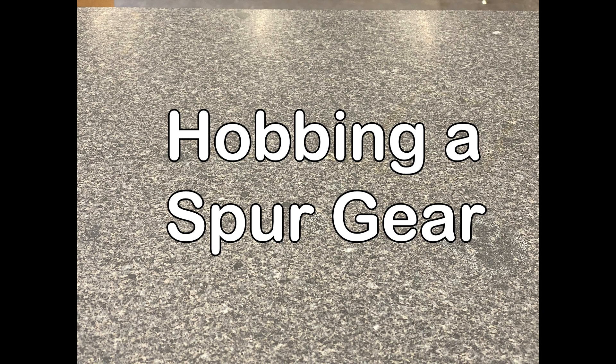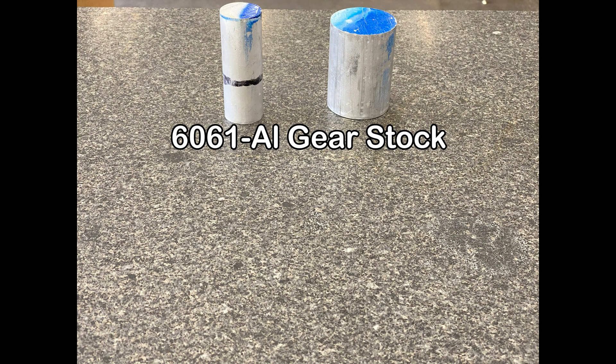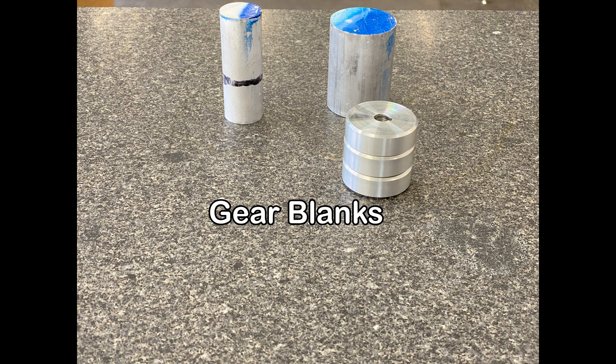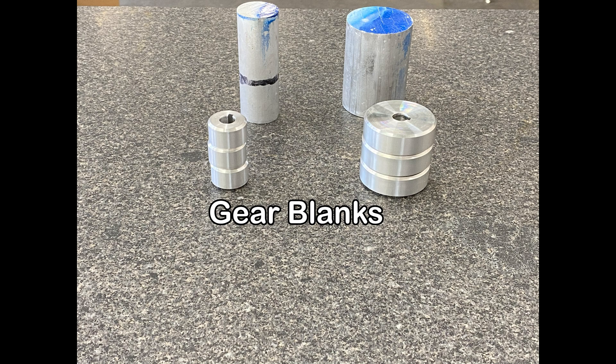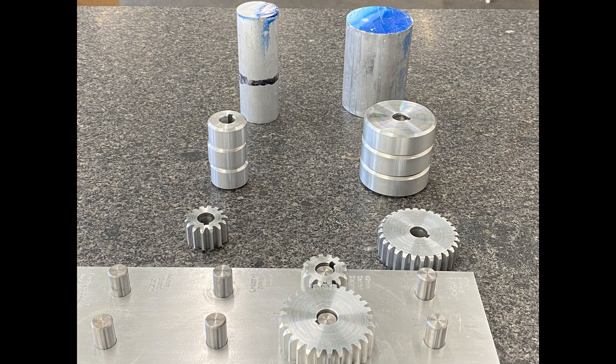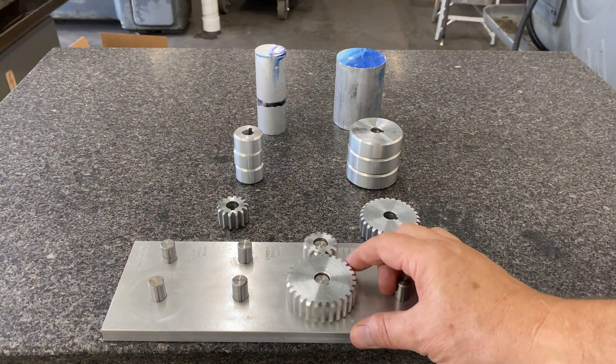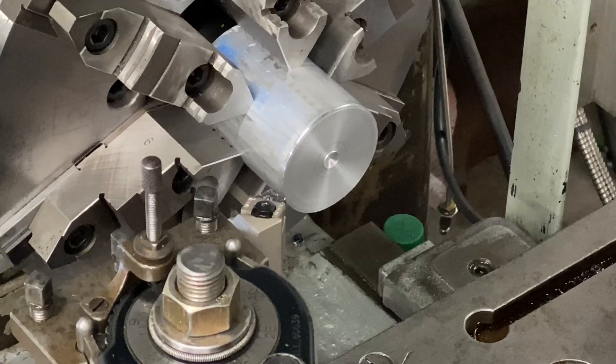Here it is — hobbing a gear and pinion from scratch. Here's some stock for the gear and we'll get some smaller stock for the pinion. Then we'll make some gear blanks in our lathe for the gear and the pinion, and we'll put some keyways in there with a broach. We'll hob the gears — they'll look like this — and if we do it all just right, in the end we'll have a nice set of gears that fit on their center distance properly and spin beautifully.